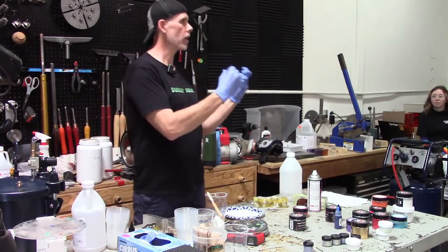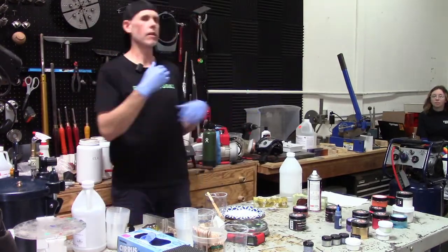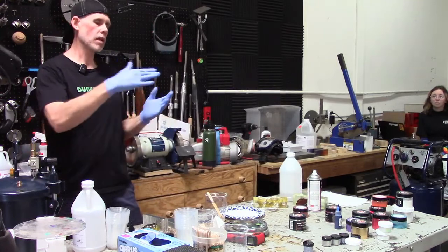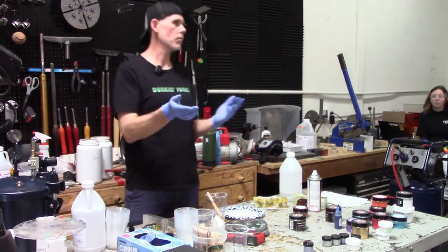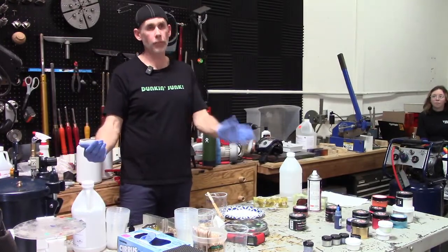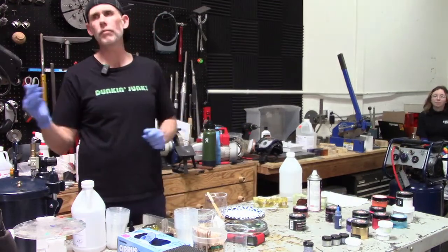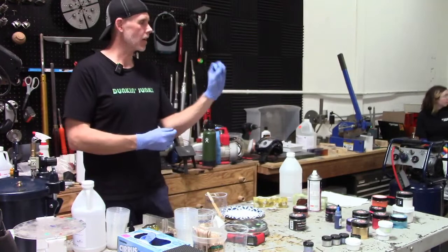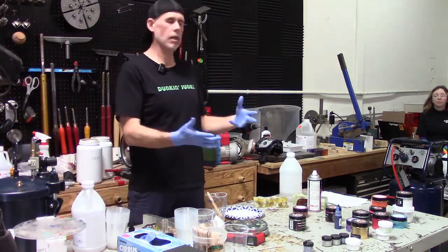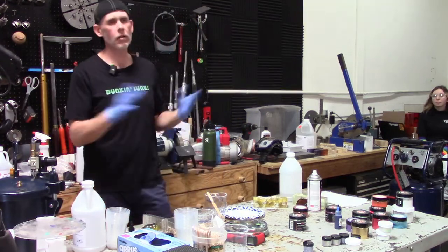With a block of wood, you want to hit zero percent moisture content. A lot of people from the woodworking world think 'dry wood' means 12% moisture content — that's not it. Zero is what we're going for with resin. The way to do it in an oven: put it in, leave it for maybe a day depending on thickness, weigh it before, weigh it the next day, put it back in, and once it stops dropping weight, it's effectively zero. For smaller pine cones, maybe half an hour to an hour is enough if they weren't just wet — the longer the better.